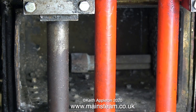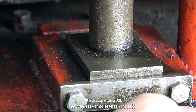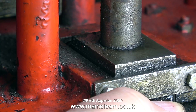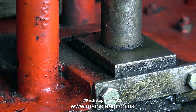So what else is wrong with this thing? Here's the underneath — this is the firebox, and the good news is the firebox is 100% dry and not leaking at all. If there had been any leaks at this stage I would have just abandoned the job, but luckily the owner said it had a current boiler certificate. The rear axle is the worst normally because the combination of an oily axle in an axle box mixed with copious amounts of ash from the fire makes excellent grinding paste. In this case the center axle is also worn, but not as badly as the rear axle.